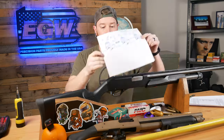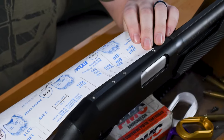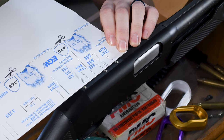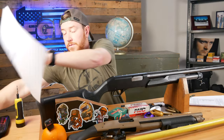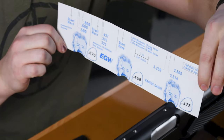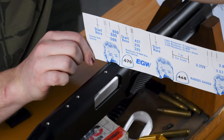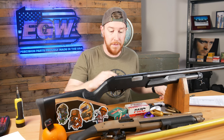You can hold it up to your receiver and see — there's a start here, and I can see that these two holes are 860 thousandths apart, so I know that our universal mount will fit. Then for the radius, we have different radiuses on the gauge and I can start here — that's too small, this one's too small but close — and 670 seems to fit. So I think our 670 universal mount will fit on there.